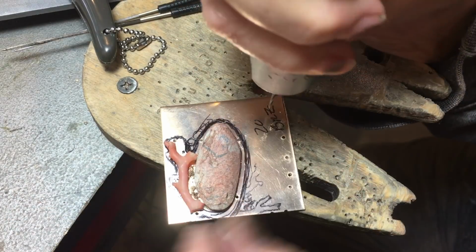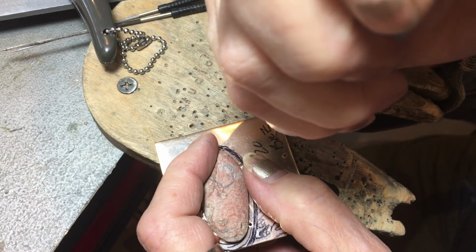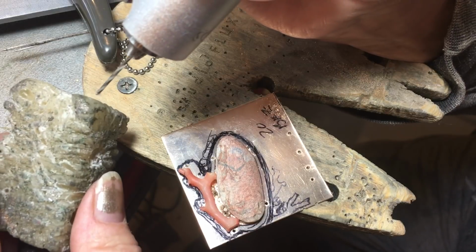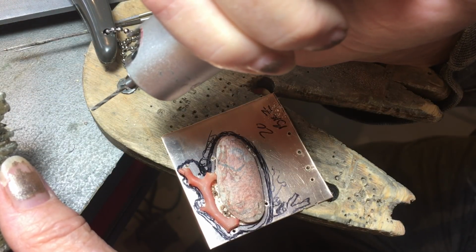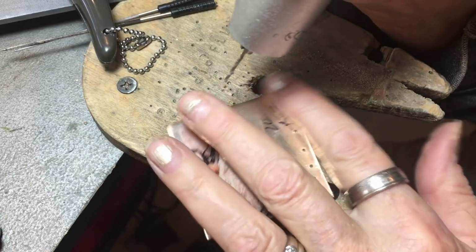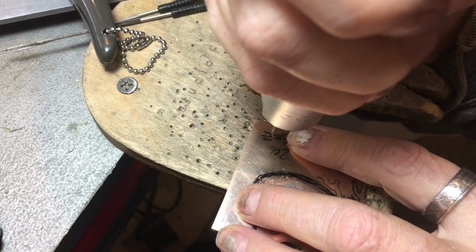If you just try to power through it, you'll end up with a big bulge in the back and a dull bit. So I'm pushing gently. You can see material is being removed. I'm going to go lubricate again. Now listen to my flex shaft. This is really fast, which I hear all the time in the studio classes. And anytime you hear it, I go running over, no, stop! Drive everybody nuts. So I re-lubricated,